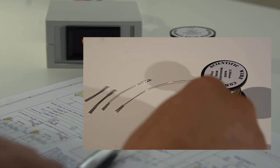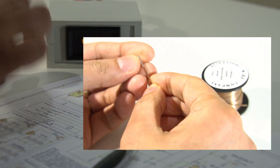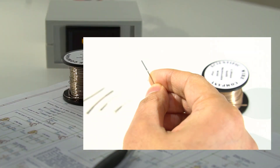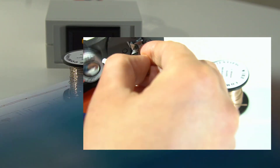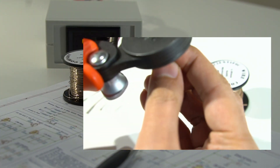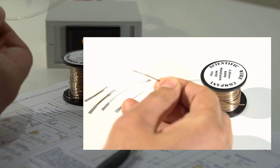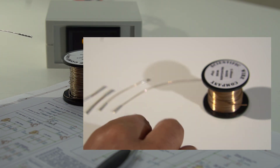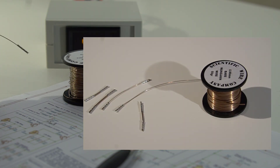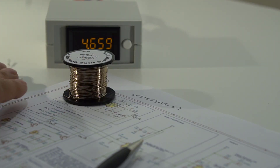The way I've been testing it is I've just been using resistance wire mainly, which is a bit cheaper than having lots of low resistances. So rather than purchasing low resistances, I've just been cutting it to a random size and then attaching a ferrule on the end as a location where I can put the clips for the measurement. I've got several of those which I've created.